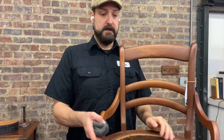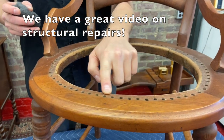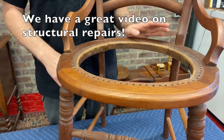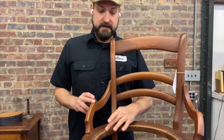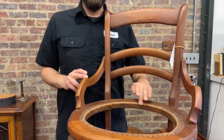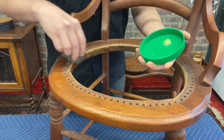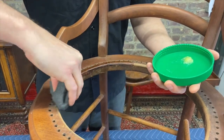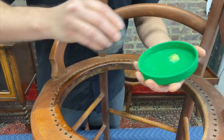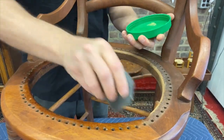Once you've got all the material removed, it's time to address any structural issues. Sometimes there's cracking in between the holes, or if you have loose joints, or if you're going to do any refinishing — now is the time. This chair is in good structural repair, so what I want to do is seal this raw wood that we've opened up with the rasp and sand. We use a combination orange oil and beeswax, rubbing it on with a little bit of fine steel wool. Usually what happens is you'll start and then end up oiling the entire chair, and the chair will be happier for it.